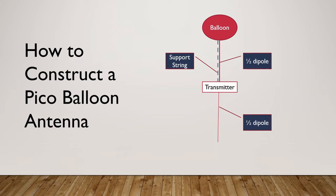This video is about how to cut the antenna for a Pico balloon. It's a very simple antenna — it's a dipole. Half the dipole goes between the balloon and the transmitter, and the other half hangs down from the transmitter. For 20 meters, which is typically the band we use, the length of the line is 17 feet. In addition to the wire, there's a string — a support string to take the weight of the transmitter, because the wire is too thin to be used as a support.